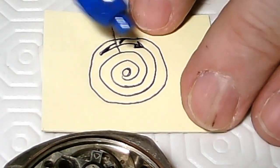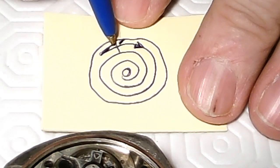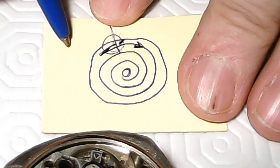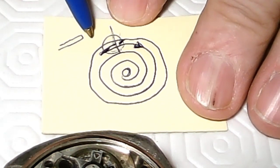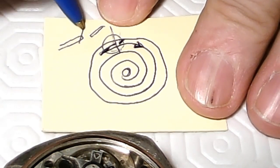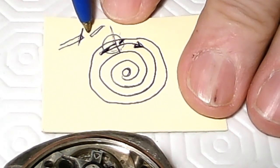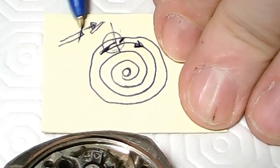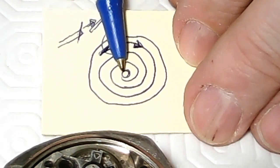So I have to take the watch apart again, and what I typically do is I can file the end of that notch to make it so it sticks on that. So if you zoomed in on this part here, you would see the piece of metal like this, right? That's the piece of metal, and there's the notch like this. And I can take this piece of metal and file the end off it like this, so get rid of this part here, and that way it's kind of sharp, so when it hits this part it slides into the groove, right? And that'll prevent it from getting unhooked from the mainspring here. So that is my plan to do that.